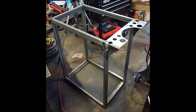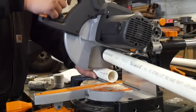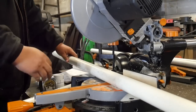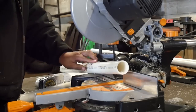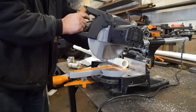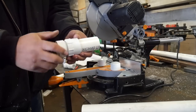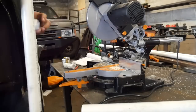Here is the completed top rack for the TIG rod holder. Two of them are larger than the other six — that's for a reason. I lost the video footage so I can't show you the assembly, but I think you get it. Right now I'm cutting the two larger TIG rod holders out of inch and a half PVC that I picked up from Home Depot. All of these are being cut for the 36-inch long fill rods, so I'm cutting the full lengths plus a little riser section for the caps.